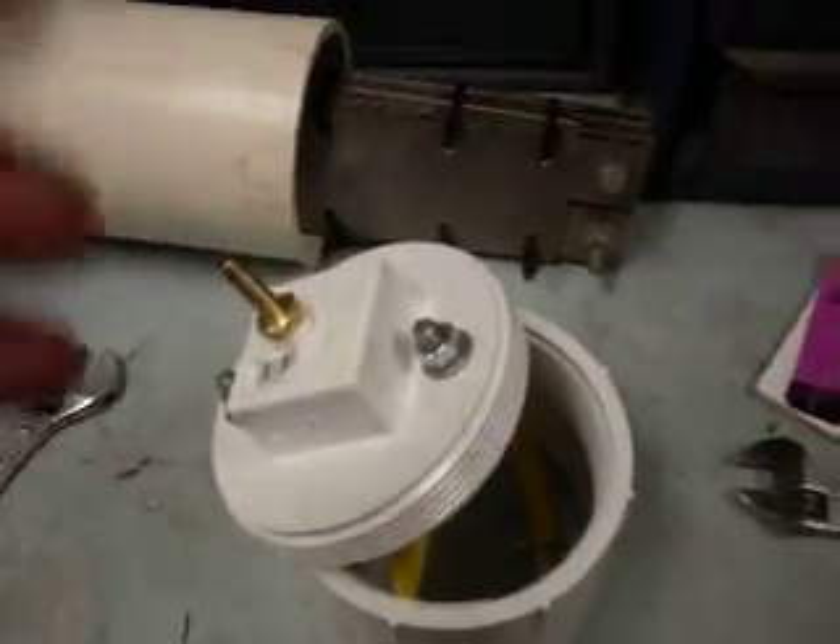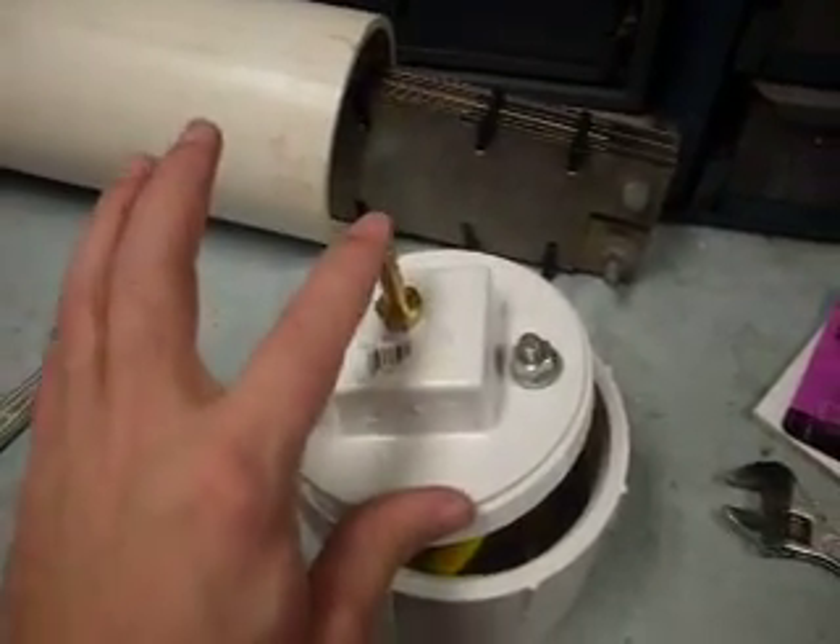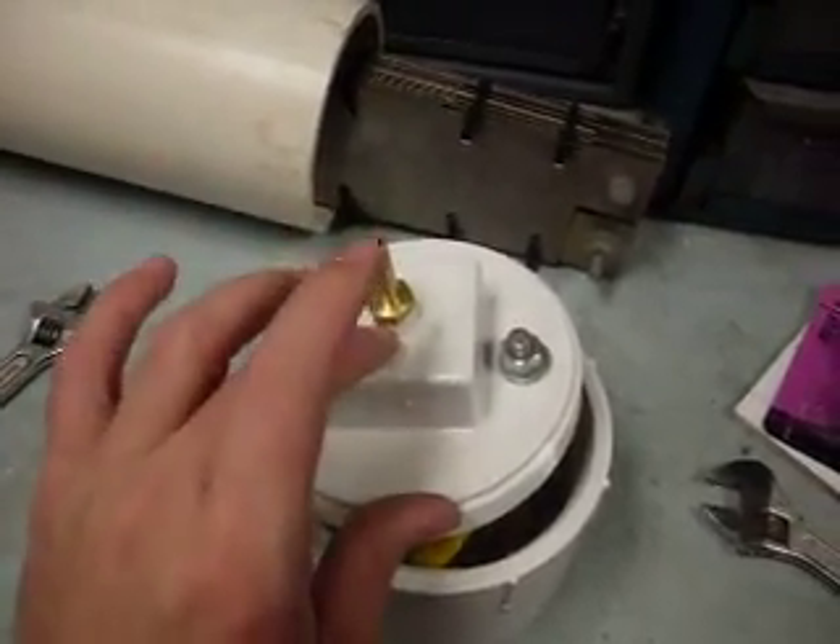So that's that one. This was a quarter inch tap with a 7/16 drill bit, and then quarter inch MPT tapped it with a brass fitting I got.